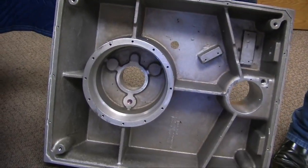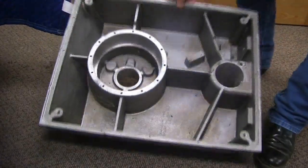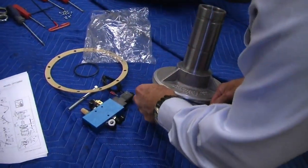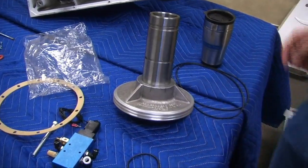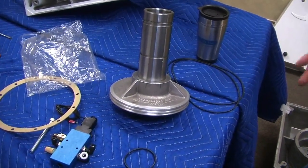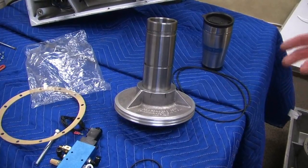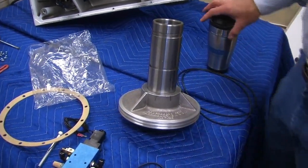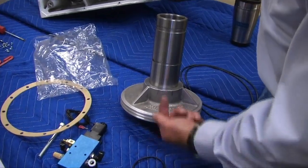Here's a big way to check this. If the customers complain they're leaking air, what is occurring is, remember, we have air force going down. Here's the piston, the way it looks in the machine, and you have two O-rings, one here and another one here, and then one up on this groove right here. What is probably occurring, since the piston got worn out and it's leaking air right away, is a water damage problem. They got water in there and literally ruined and corroded the cylinder grease, and it's worn down the O-rings.